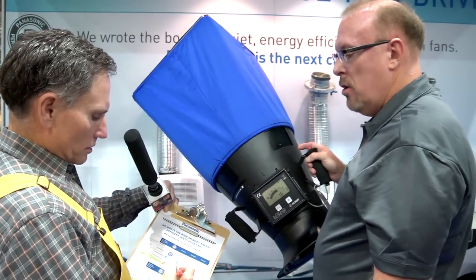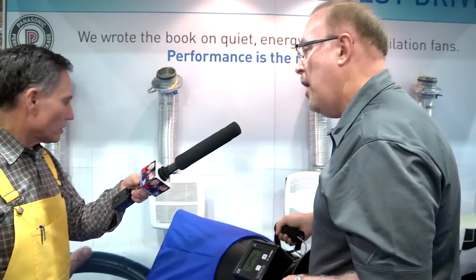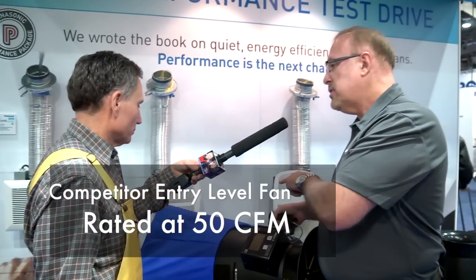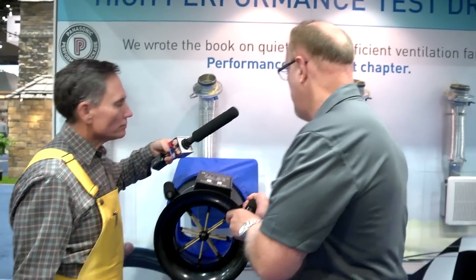Package A. But now let's move down to this manufacturer's entry-level Energy Star fan, keeping in mind that you need 50 CFMs installed to meet ASHRAE 62.2. James, what would be your guess that we come in on this one? You know, the EcoVent, you got 51 and passed. What do you think about this one? I'm going to guess that this will give us 47. So I've got the balometer on there.